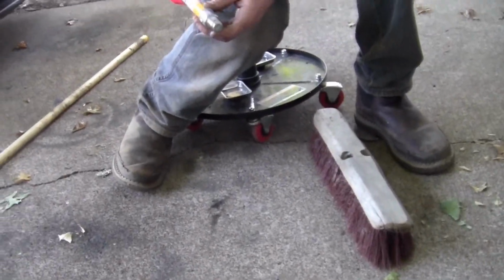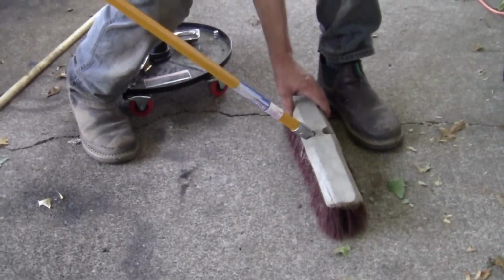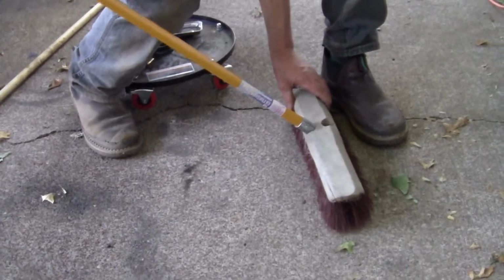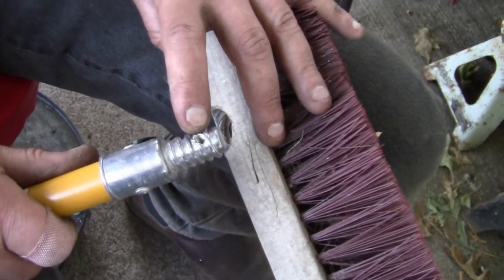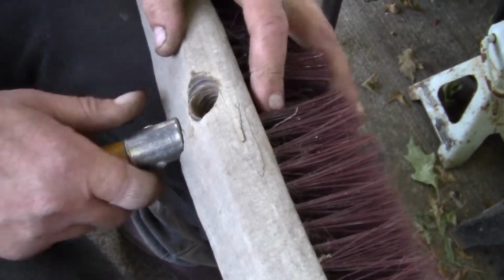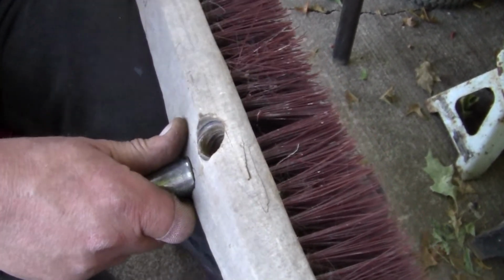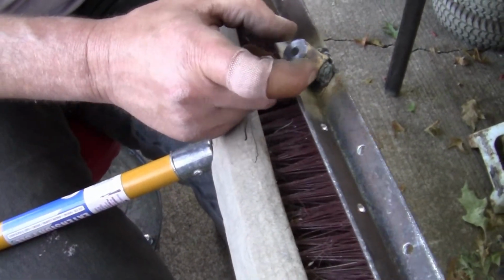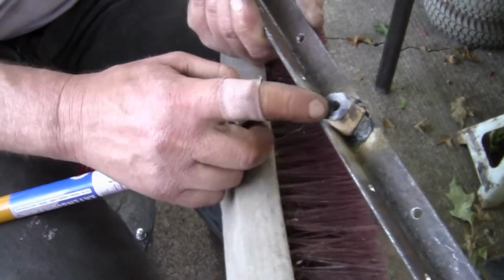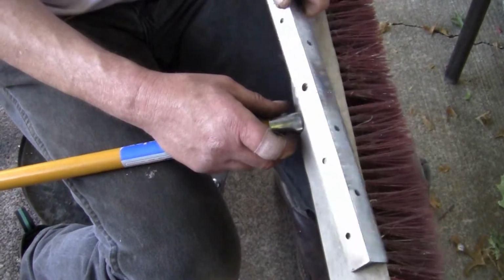Okay, now you drill what I did. Stick it in here like you normally would. Bring her on in here, buddy. Then you drill and tap that 1/4-20. To locate that, what I did was I located it right up against the bottom of the hole. I made this piece. All you need is a 3/4 inch piece of angle iron with a 1/4 inch hole through the center, out of your scrap bin, and some holes for screws. You put that in there.